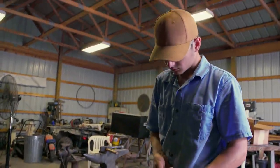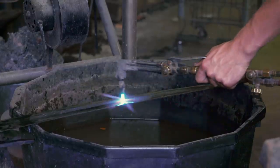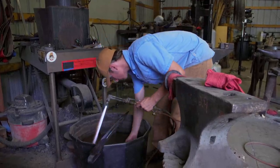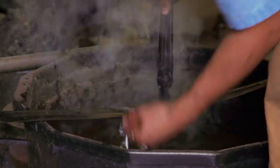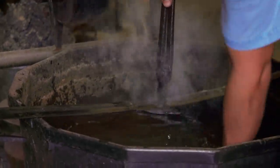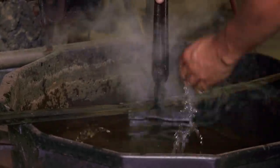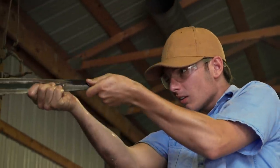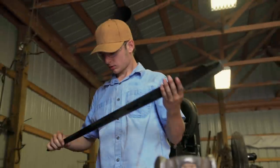Oh, it's taking a warp. I'm really struggling here. I'm bending it, seeing if it will straighten. I'm heating it up with a torch and trying to drop water droplets on it to see if I can set it back into shape. I finally get this warp out by taking my pair of tongs and pushing down on the sword. That straightened it out a little bit. Trying to fix the warp really set me back, but tomorrow I'm going to come in with a fresh mind and see what I can get done.